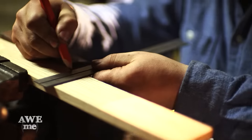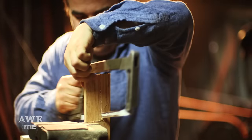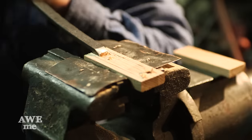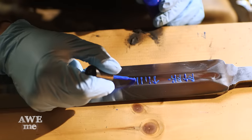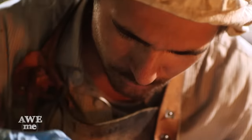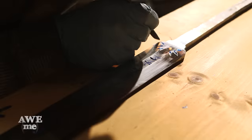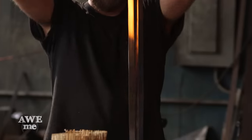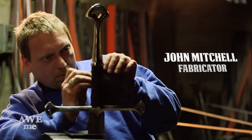Using a handsaw, Sam cuts down wood so that we can begin to carve this handle. Using a chisel, Sam cuts away the area where the tang has to go. Keeping up with the challenge, I'm going to use the method called etching. Etching works by applying resist to clean polished metal and then submerging it in acid with the purpose of eating away the unprotected surface. With the resist in place, Matt moves the blade to the etching bath. Now that we have the guard and pommel attached to the blade, we lay on the sandwich pieces of wood for the handle and cover it in leather.